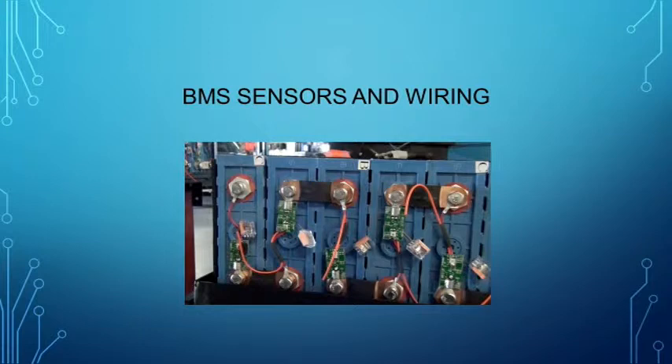If you look closely, it appears that the terminals or posts are very close to the bottom of the battery box. However, there is about three-sixteenths of an inch between the battery box and the post on the cell. We also put a one-eighth inch piece of plastic shield that covers the entire front of the box to protect the cells from road dust, moisture, and to insulate the cells from all metal.